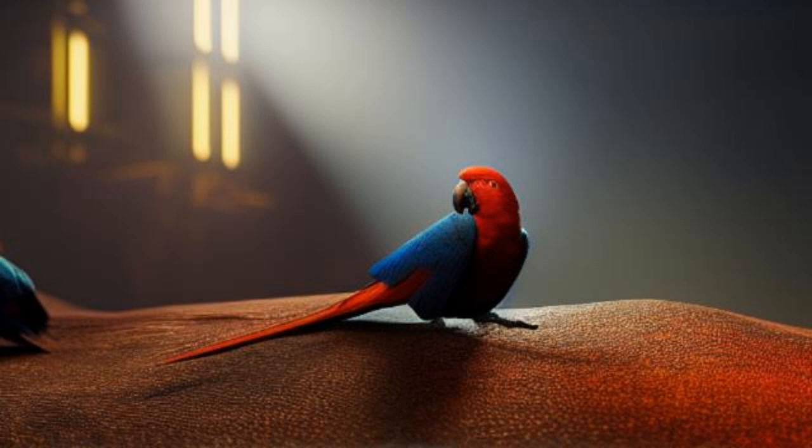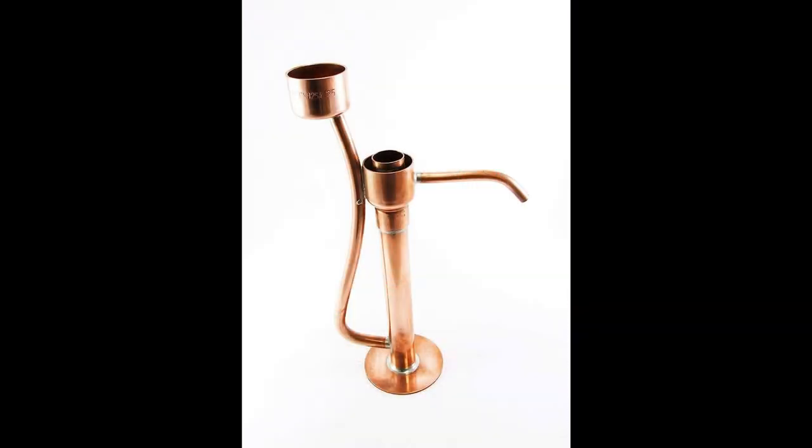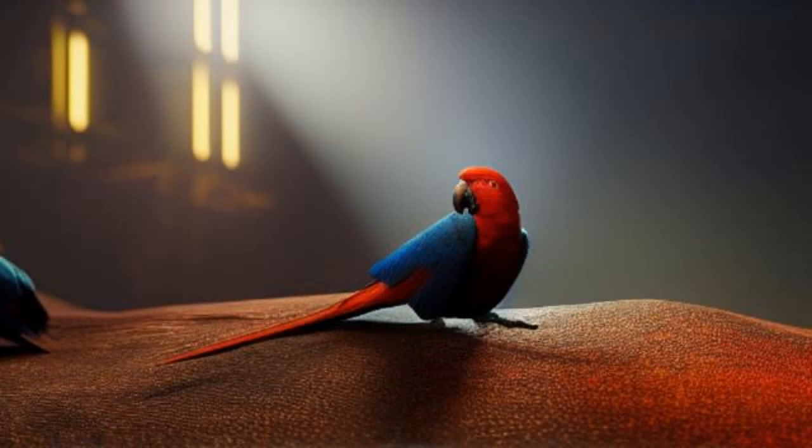A distiller's parrot is a simple device that allows a hydrometer to be floated in a stream of distillate. It's called a parrot for obvious reasons, and it is the standard way of monitoring the proof of spirit as it is made. It is the same for continuous distillation as for pot distillation, but there are a couple of complications that continuous distillation brings to this simple instrument.